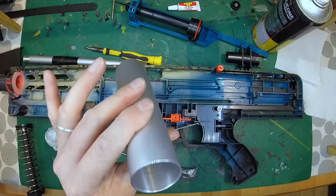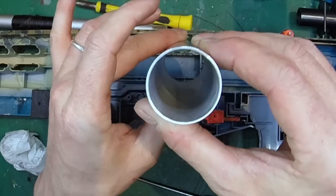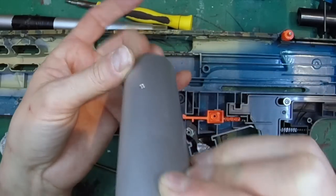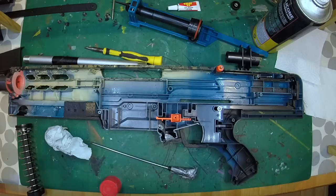Now I'm going to remove any grit from inside the plunger tube — just spray a little silicone and then use the wad of paper on the pull-through and push it through. You'll see it removes quite a lot of black residue — that's the oxidisation that occurs inside the aluminium tube, just a layer of aluminium oxide. That's why polishing is a good idea. You don't want a shiny finish in there though — that's not as good for a seal. You want that cross-patterned finish from the honer. Sight down the plunger tube to make sure it's free of grit and scratches before reassembly.